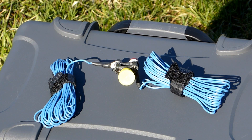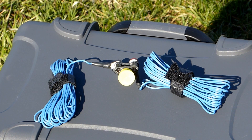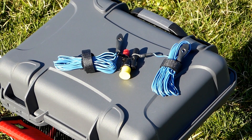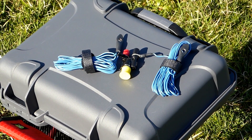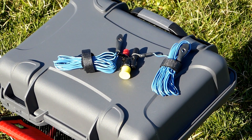Maximum power rating is 50 watts. Two hook and loop wraps are provided to allow for neat storage of the two radials. Also included is a BNC protective cap for the male BNC connector. The price is a very low 22 US dollars and shipping is free for customers in the United States. The wire used is 20 AWG stranded UL1007 tinned copper antenna wire with ring connector eyelets at each end. The feed point connection is a binding post with a BNC female connector, thoroughly insulated with waterproof marine grade heat shrink on both ends for maximum strain relief. All electrical connections are soldered using silver bearing rosin core solder.